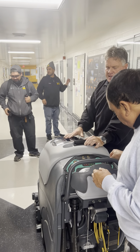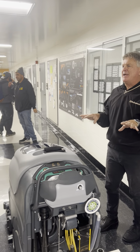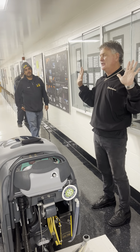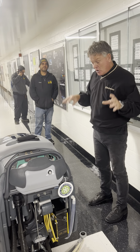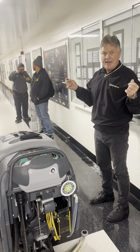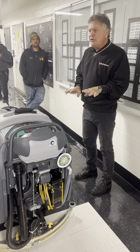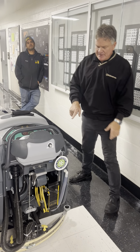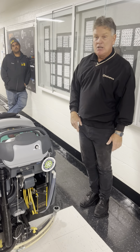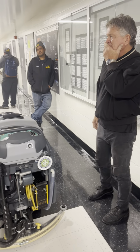As you know, some machines, it makes perfect sense. I think you have machines on this campus, industrial machines, internal combustion engines, hydraulic hoses. You need some special tools and some special training. On this machine, to maintain it properly, in my opinion, you don't need any tools. You need your hands, your eyes, your ears, your brain, and some cleaning stuff. On the very rear caster, there is a Zerk fitting to grease the bearings, because it's a live caster. Once a year you could take a grease gun to that, or just cut all the hairs from the back, because the hairs get clogged.